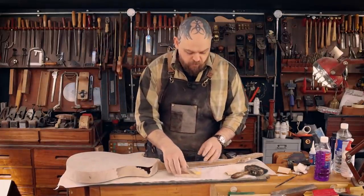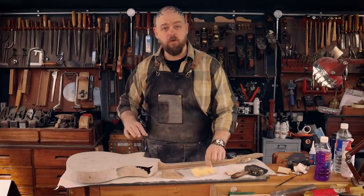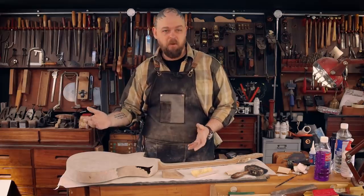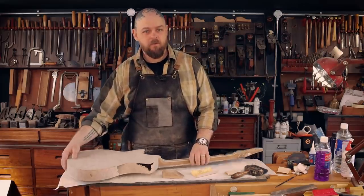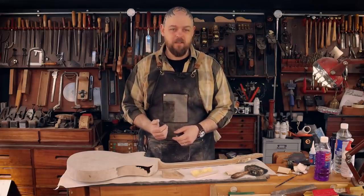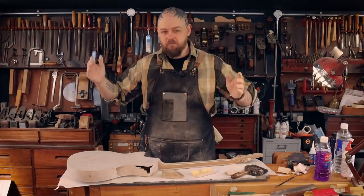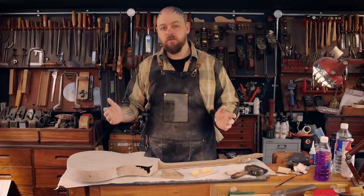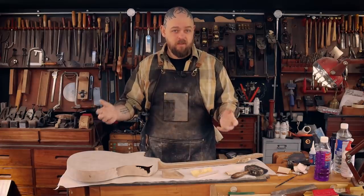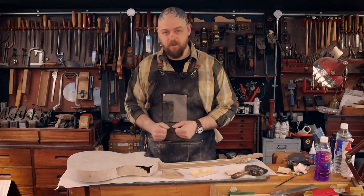So at the end of the 320 grit, I'm going over the whole thing. You saw me sand, I nearly said with the grain. To try and sand with the grain on this would drive a man insane, or more insane. I random orbitalized it as the final pass, and we're about to apply the first coat of stain, basically. Let's do that.